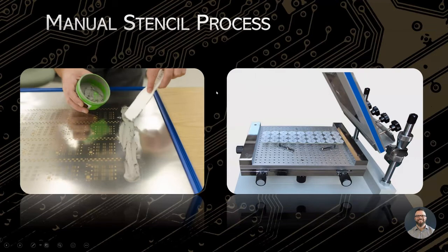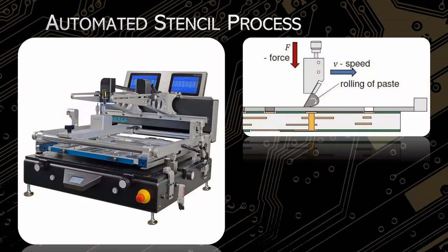Wouldn't it be hard to keep everything aligned? Yes, it can be extremely difficult. This process is extremely manual. There are better setups — people can create jigs and technologies. There's also the automated stencil process, which is the next step up, where they start trying to control more of the positioning, how much pressure is applied, how much paste goes down, and the speed. All of these different factors can change almost the entire success of the board. If you don't have a good process for applying solder, you will not have a good process for manufacturing your board, and it just won't work as well as it's supposed to.